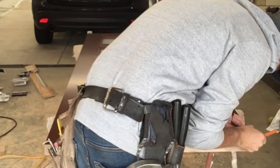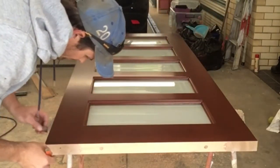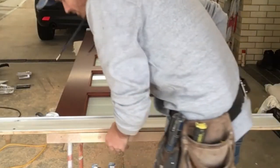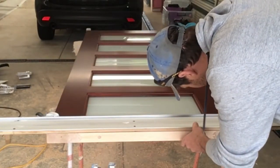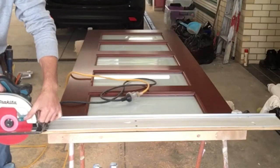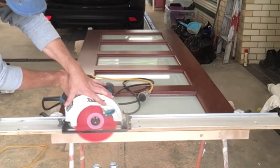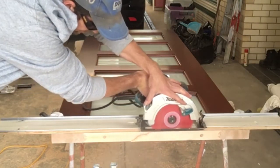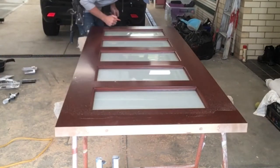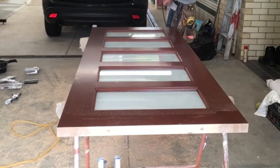Fit your handles and hinges. It's worth noting something I like to do when using my saw to cut the edges of the doors: I like to put it on about a two-degree angle, just to give it a bit of a bevel, so there's no chance that the leading edge will get jammed. It makes the inside edge look nice and tight, and if the door ever swells over time and you try and rip it open, you could rip a chunk out of the leading edge. So I put a bevel on it — it also gives a greater chance of it looking tight while at the same time leaving the leading edge free to clear the jamb.